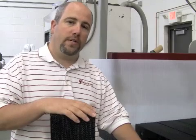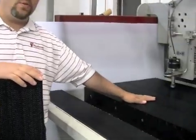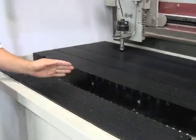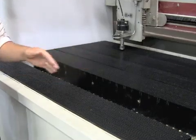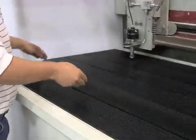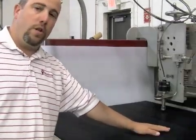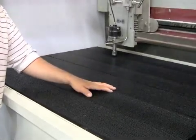Let's talk about how to use the bricks and how to get them inside the table to make a bed. As you can see we've already laid some of the bricks out. The best way to do this is to look at your slats — most tables have slats — and you want to go perpendicular, 90 degrees to the slats, to give the bricks the most strength. So what we're going to do is take the brick, slide it in, and you can push them tight. The bricks are actually perfectly planed flat to a given height, which provides you a perfectly smooth, perfectly flat surface. That's really important for cutting glass and brittle materials, so you don't get any pressure points when you're trying to pierce them.